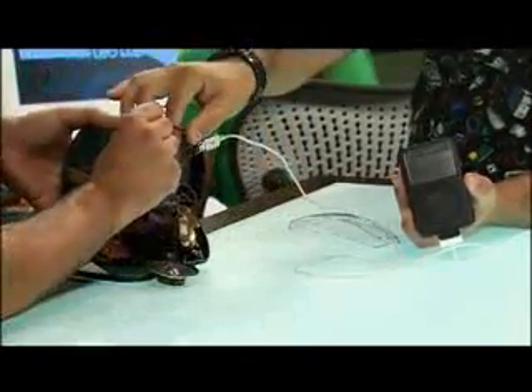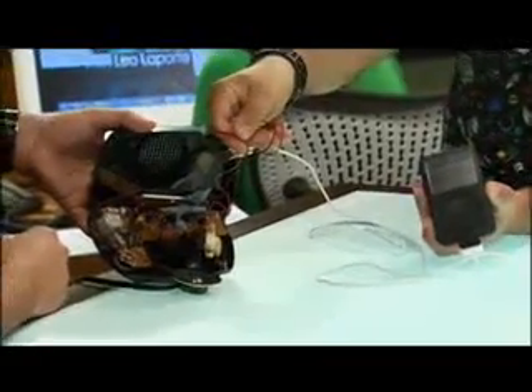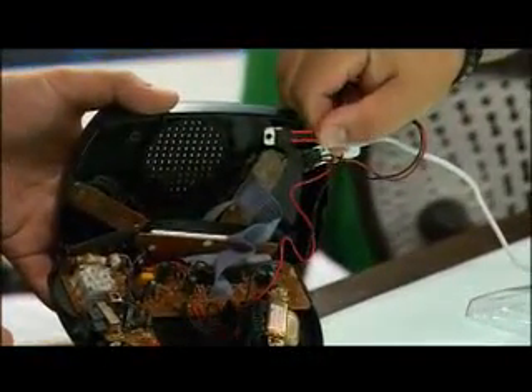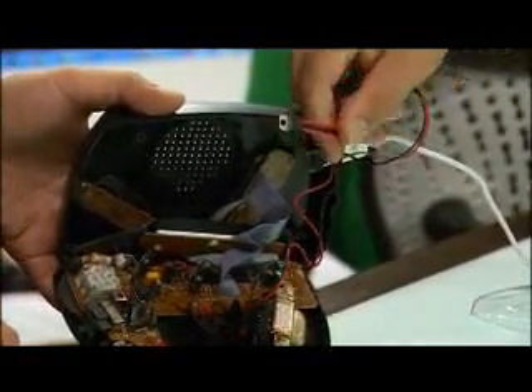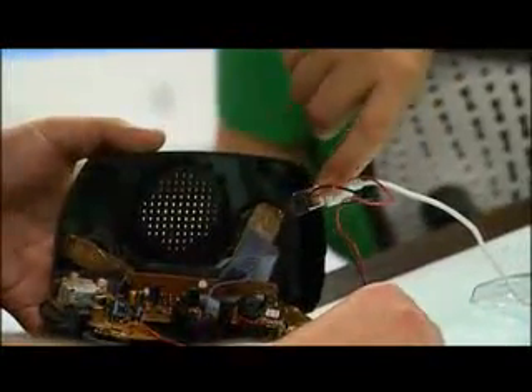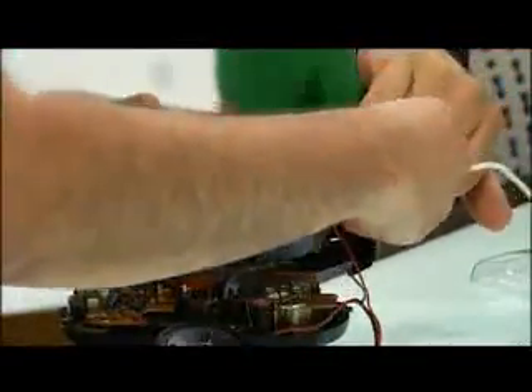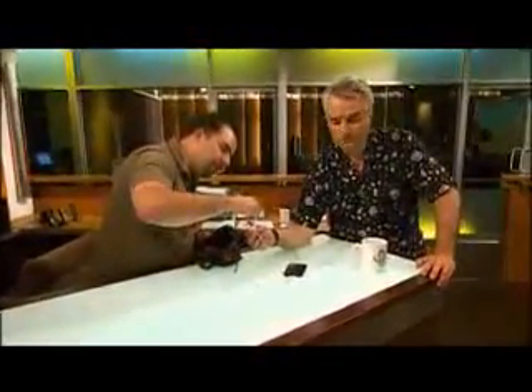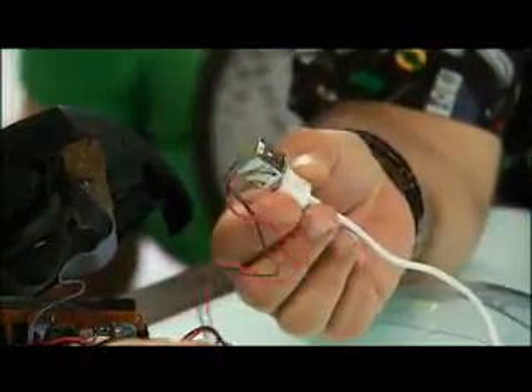The red and black come into the 7805 voltage regulator. That little thing is a step-down — it's like 15 cents to buy. Then you're splitting it and the second output goes to the USB ports. And how did you cut a hole in your clock? With a very sharp knife — actually a hunting knife. So you cut the square out, and this is a compression fitting: the little ridges on either side lock it into place, so you don't actually have to glue it. By snapping it in, it holds the port in place, even when you put pressure on it pulling cables.